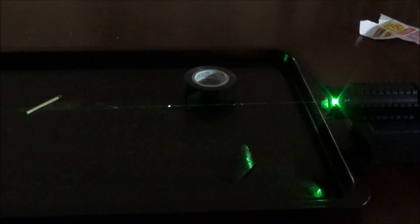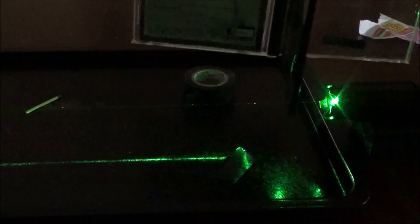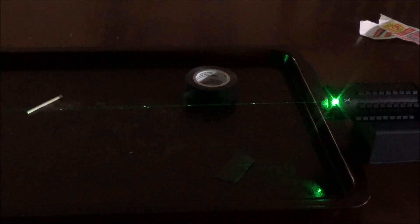Next up is the black plastic part of a CD case. Mine was clear with a little black plastic piece in the middle, so I'm burning that part. The same thing goes with really any plastic material you're burning — try your best to breathe in as little as possible. Small amounts here or there aren't going to kill you, but long term it could become an issue. If you look closely you can see that the beam is piercing the plastic and burning all the way through, so when doing these burning tests just make sure both objects are steady — the laser is steady and the item you're holding is steady as well.